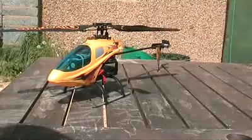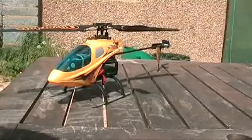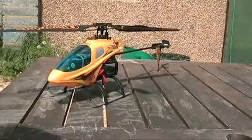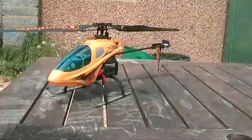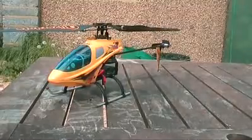I use a plug-in timer set for two hours, because it doesn't matter if you slightly overcharge it. The only thing you have to be really careful with a lipo battery when charging is they have been known to explode and cause fires, so never leave a charging lipo unattended. And when you're flying with a lipo, always stop flying at the first signs of the battery getting low, because if you overdischarge your battery with a lipo, then you'll ruin it. So if you stick your battery on charge, then while it's charging, we'll go through the setups and checks.